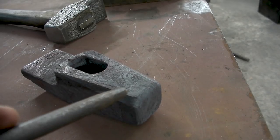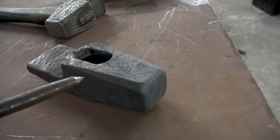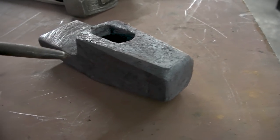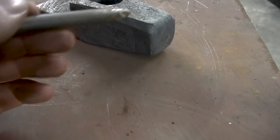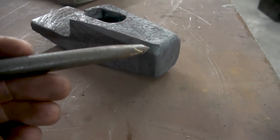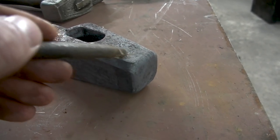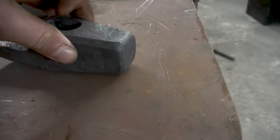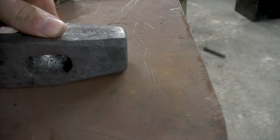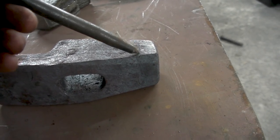There was a clear difference though between the oxidation color, but then again, that is what you see with Damascus steel as well. So that is nothing out of the ordinary. So all that stuff doesn't stand out very much. If there's discoloration in temperature, that's not good. I mean, not so much in the oxidation color. If this thing is going to fail, it could happen around the entire periphery, because we got that line here still as well.